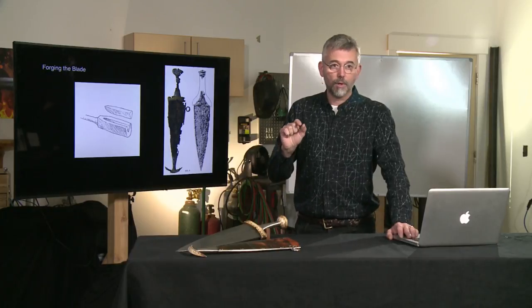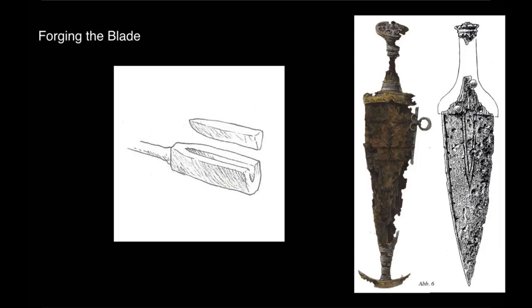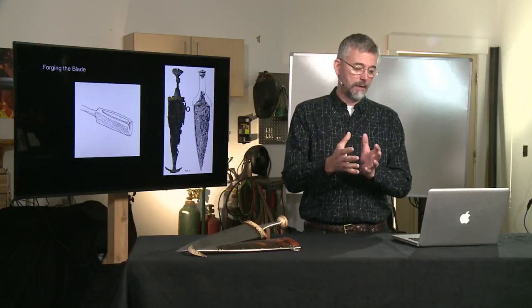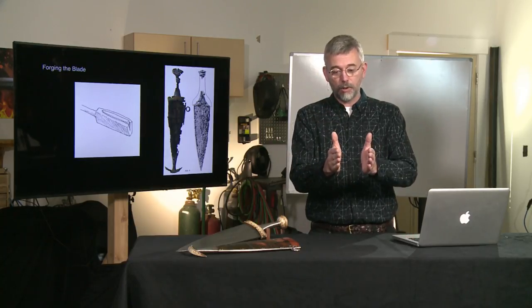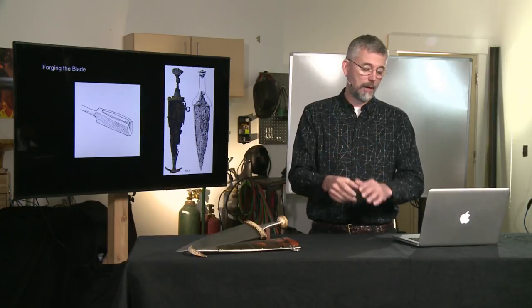You forge this down to a more square cross-section. By forging it on the high, it swells in the sides and you get something that looks like this. With a blunt chisel, I cut up a slit in the piece of wrought iron. A little length of carbon steel is then forged in this sort of canoe or boat shape that fits down into this slit. It is sprinkled with borax and driven down into this bedding. I make it ever so slightly shorter than the slit, because that allows me to pinch the ends of the iron over the end of the steel, and that keeps it snugly in shape.